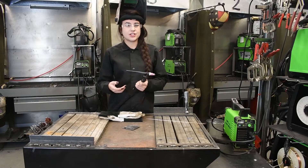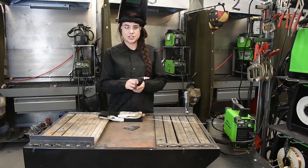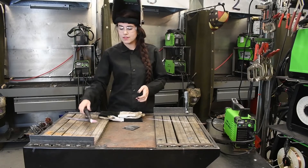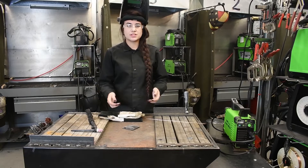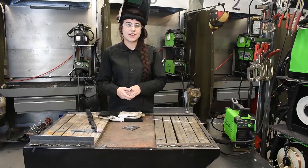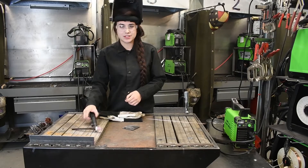In order for the gas to turn on and off on this machine, you do have to open this valve here on the torch neck and then close it when you're done using it. In order for your weld to be shielded, you have to make sure to turn that on. If you do not turn that valve on, it will contaminate your tungsten as well as your material.